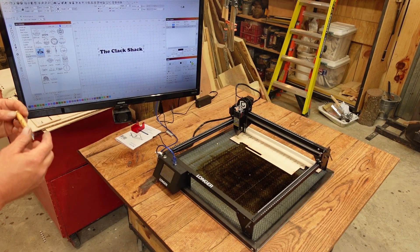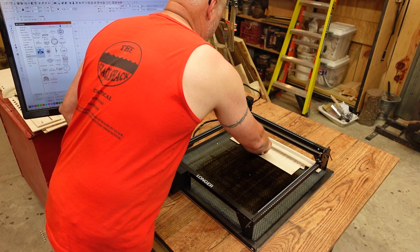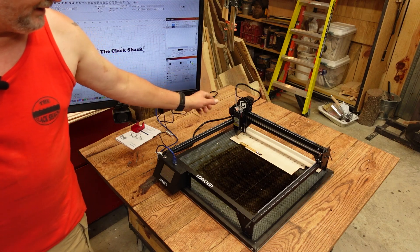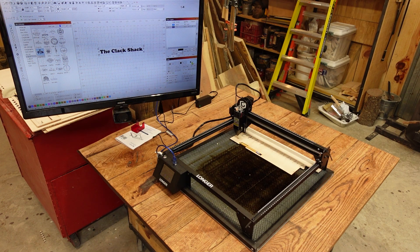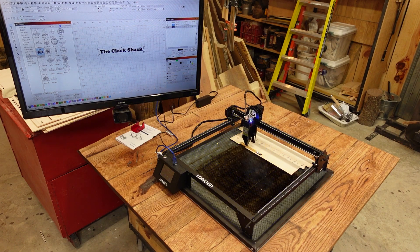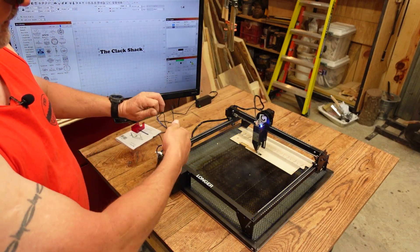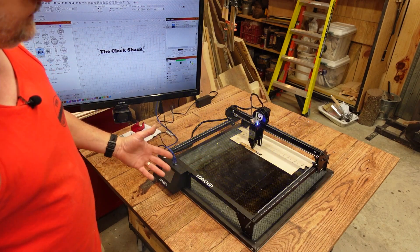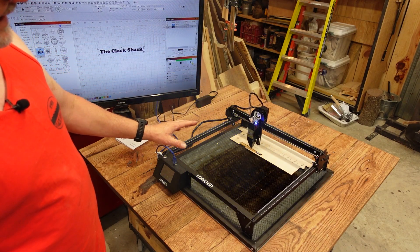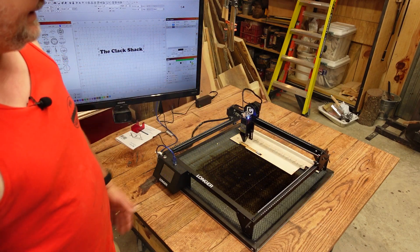What I'm going to do now is flip it over to the opposite side and put the same text on there. The way I built my little jig, it allows you to flip the metal piece without having to turn it on the pin. This also helps you make sure that if you're doing two-sided engraves, the two engraves are on opposite sides of each other, because you flip that pin from that side to this side. That way you don't have to try to turn the clip when I'm at events. I've got my booth set up and I do a lot of these.